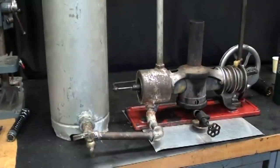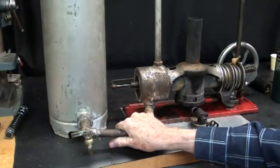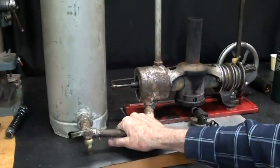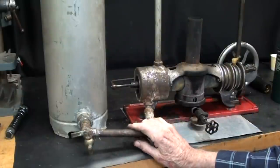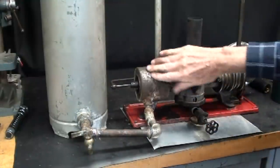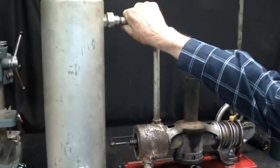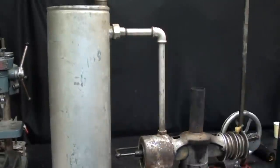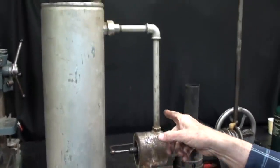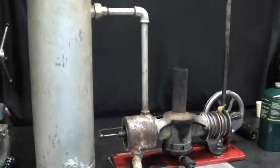Just a little afterthought — extra credit. This pipe right here is ice cold because it's February and the water coming into the house is very cold. This section is just medium, and then I can feel that this is warm all the way up to the union. So there is circulation right now by thermosiphonic action — that is okay, that is not the problem. Well, that's the end of extra credit. See you next time.